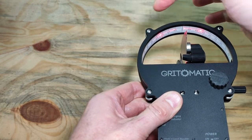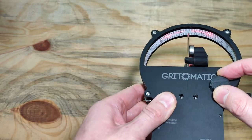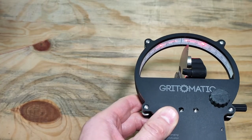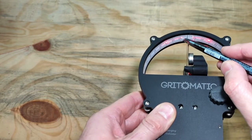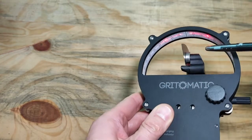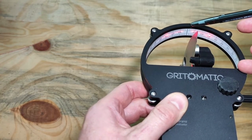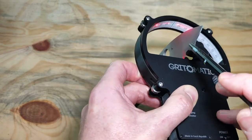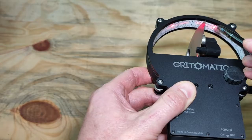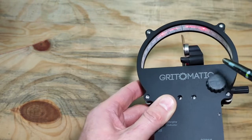You can see we have two dots in the center and two dots to the sides. I am going to adjust the scale to center everything nicely. Those two center dots represent the primary grind of your knife. This knife is approximately 3.5 degrees primary grind. The edge angle is the second dots on the sides — this is a nicely polished edge, so you see a crisp dot appear. The edge angle is 15 degrees left and 15 degrees right, so 15 degrees either side.